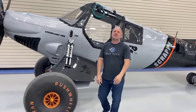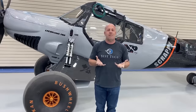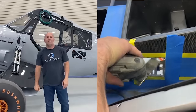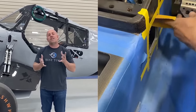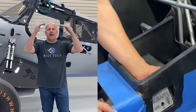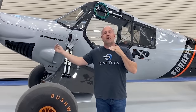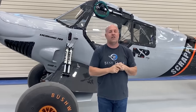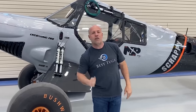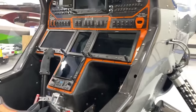It sounds complex, and since there are added areas where you could have a leak, like a valve or a hose, I added a redundancy backup, which is simply this. Right behind this line, it goes to a series of mechanical lockout valves, so that there's nothing that could fail on it. If for some reason I saw the pressure bleeding down on one of the gear, and my light all of a sudden comes up and says your left gear pressure has dropped 200 PSI, or 50 PSI, or 100 PSI in relation to another, and I didn't do it, well, no big deal. It means I've got a slow leak. I reset that gear to the pressure I want, turn the lockout valves, I isolate the entire electronic system, and now I have a traditional landing aircraft.